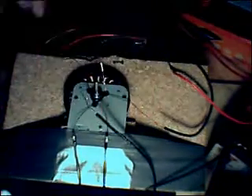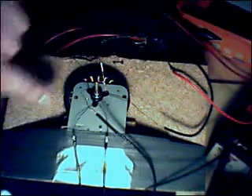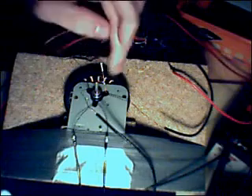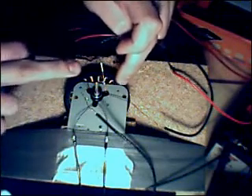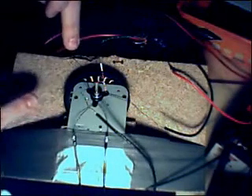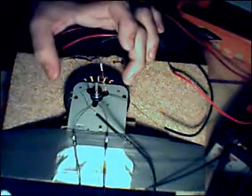Inside that ring is the set of coils. If you notice these three black parts that come away from the axle, that is how I've got them separated. These 24 coils are in three sets of eight — so eight here, eight going around this side, and then two eights in series to make the next coil. So one coil is eight here, and the next part is the other two on this side.